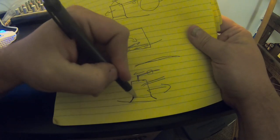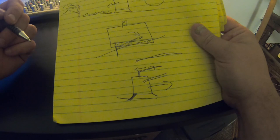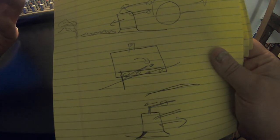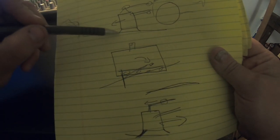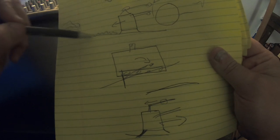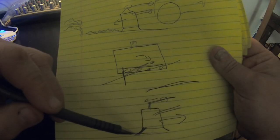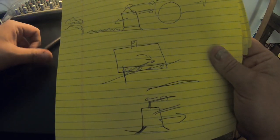So that helps smooth out all the material you're driving over. So in this method of grading, this is how you do it. And you depend a lot on that rear blade to scrape off the top. And then if you angle it to the side and cock it backwards, you'll smooth out the ground as well. Okay, back to the video.